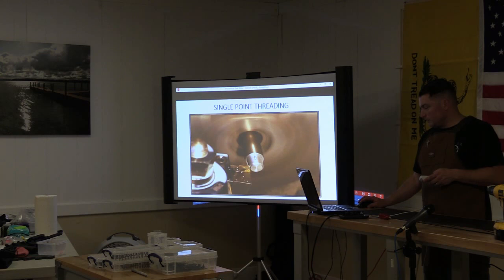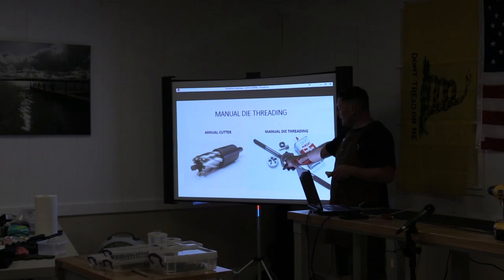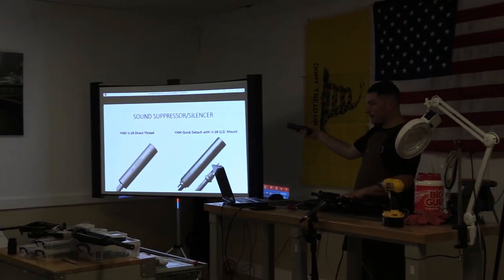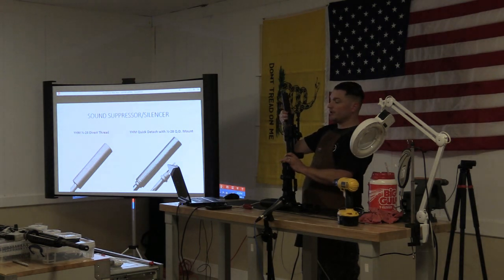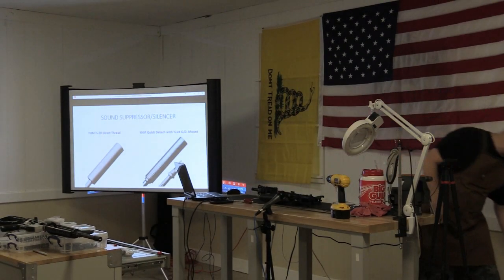You can't manually thread for a suppressor either — suppressors need a shoulder. We actually talked quite a bit about suppressors too, which I thought was really interesting how he integrated that into an AR armorer's class. We have a short clip of Chad talking about suppressors. Since you're not using direct thread, you're not stuck with that thread pattern — you can get mounts for different guns that accept the suppressor: an FAL, a G3, an AK-47 — and move that one suppressor between several guns.